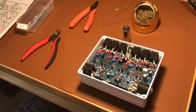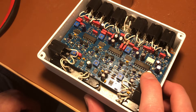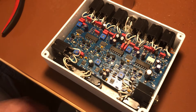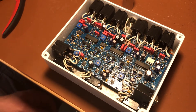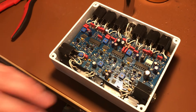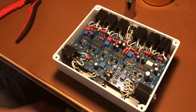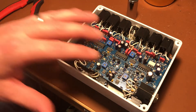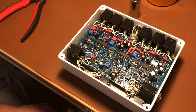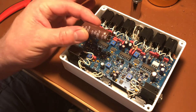First is this filter capacitor right here, on the virtual ground. This is a 680 microfarad capacitor and it's basically not big enough. In order to make the Klein Bottle as low noise as possible, the internal impedances and resistor values I had to use all over the place were much less than you'd normally see in a guitar pedal. Because this virtual ground wasn't filtered as much as I later realized it should have been, there is some signal bleed and crosstalk between the channels.